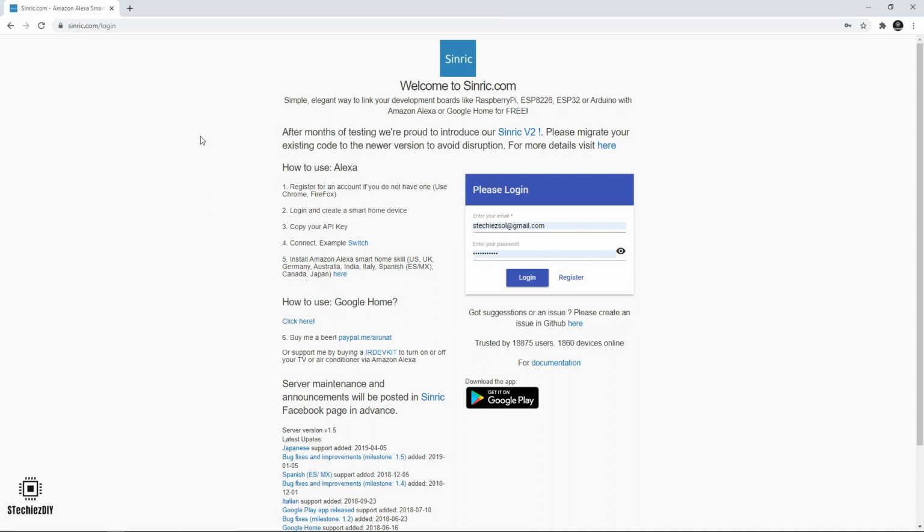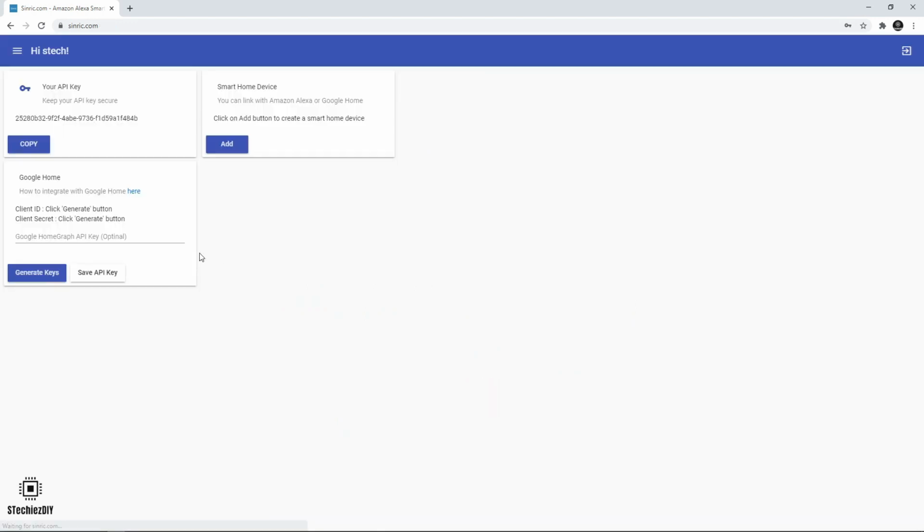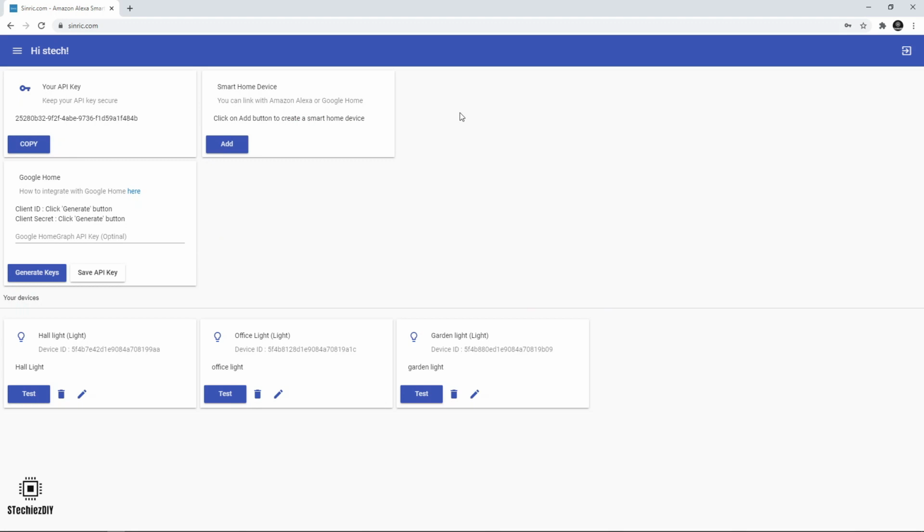Now we'll be configuring Sinric. Sinric plays a vital role to control the ESP8266 or ESP32 using Alexa. We will have to create an account on Sinric first. I already created an account, so I will be just logging in.